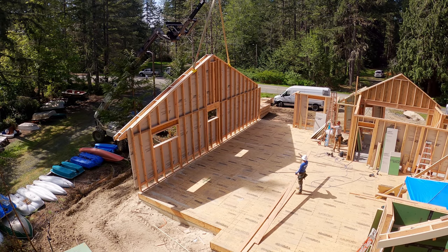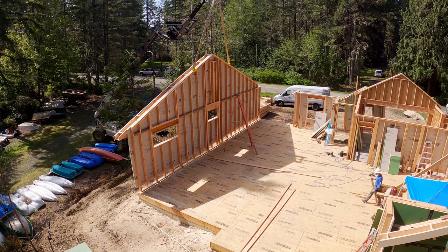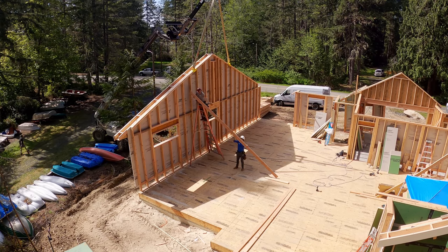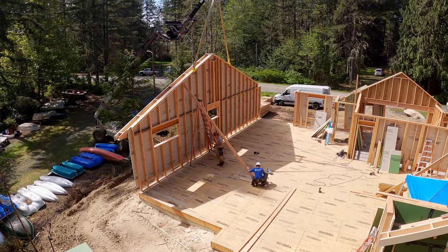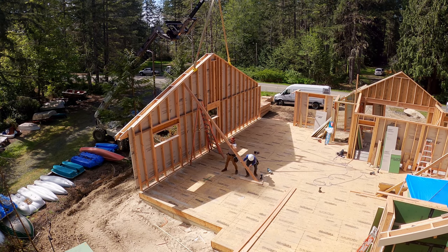That wall is lifted using brackets that are custom engineered, custom fabricated. We keep those drawings in case the safety police show up, we can show them that. We have shown them those brackets before. They are each rated to lift far more than the heaviest wall we've ever lifted, so we're generally lifted for about four times the weight. Now, one thing to know though, is as the wall goes up, as long as it stays on the floor, the forklift will see, so to speak, less weight as the wall goes up.